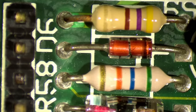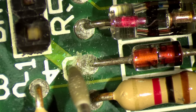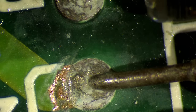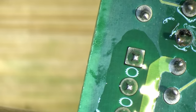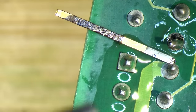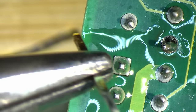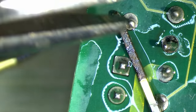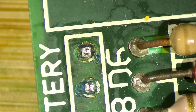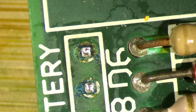So the only thing left are these pieces here. I think here we also need some wire. This, I think, is too weak. I think I should remove this battery connector now. Yeah, see, there's nothing of the coating left on this pin. Same here. I think there was a lot of corrosion on this battery connector, if I'm not mistaken. Let's see how the other side looks like. Yeah, here you can see how the pins left the square imprint here. And you can still see some of the corrosion as well.